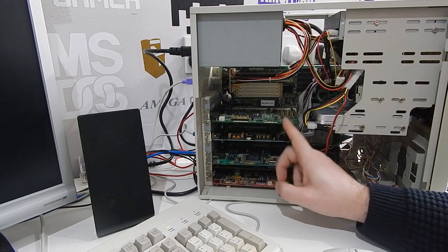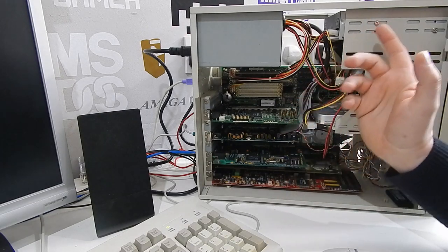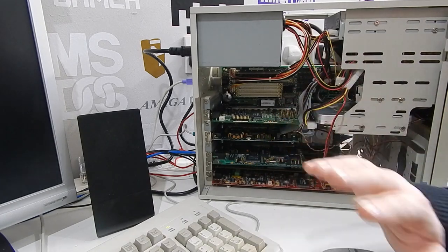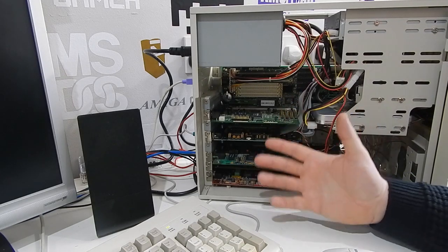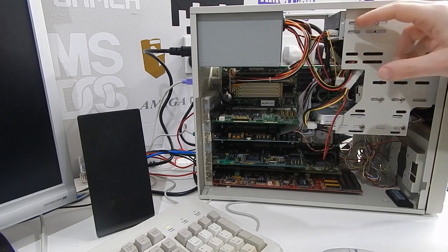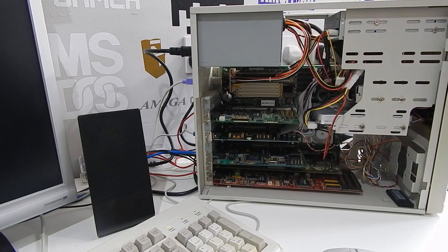The CD drive is also being disconnected, but to be honest with you anyway, that Sony CD drive is not that great. Yes, it is nice to have in here, just as it came with this machine, but it does not read CDRs, and the majority of CDs I would be using will be CDRs, so what I'm going to do with this in the future is just swap it out for an IDE drive, and just connect that to our Super I/O card. But that's enough negativity for now.